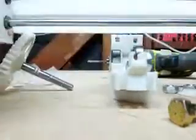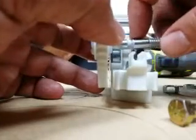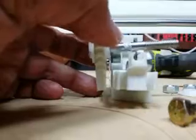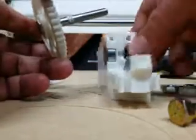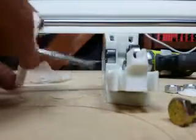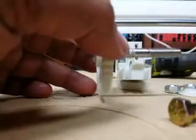the filament centered. Because in lieu of having a deep ridge in your hob bolt, that's what's going to keep your filament centered. Although it does very little, in my opinion. I think the filament gets guided more by the filament hole than anything else. But anyway, so at this point, all I can do right now is just show you how I hob a